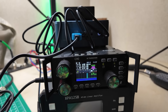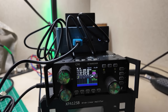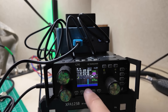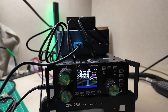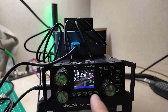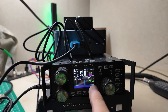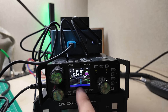Let's take a look at it on the front of the radio while we're adjusting that power slider. We're still at one watt and I've got the radio into transmit mode. I am lowering the power slider on the screen, and you can see that ALC number is rising up — we're at 42 now, getting pretty low on the computer. You see how this went to solid green instead of bright red? That's a good healthy clean signal. There's 100 ALC and we're putting out 1.1 watts. You can actually see the packets going left and right of center as FT8 sends individual units. That right there is a perfect looking signal on your G90 — ALC at 100, a nice straight line that isn't bright red.